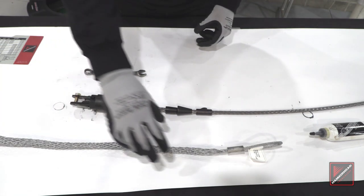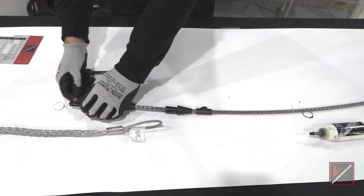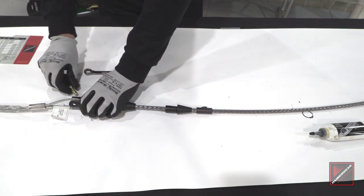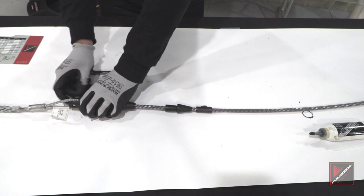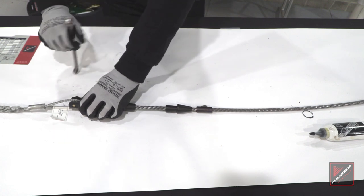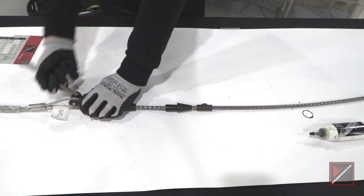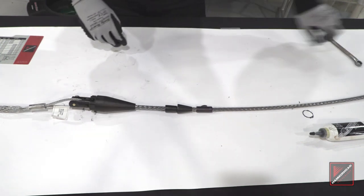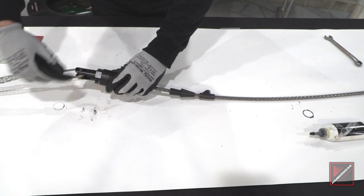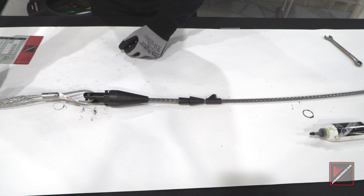The next part we're going to put on is the pipe puller itself to bring in our new product line. We're going to take out the screw back in this clevis, place a loop on our pipe puller in the clevis, and tighten down that screw and torque it up. Now that's ready to pull. We can also run the tracer wire through the milled relief clips on the nut itself — tape it to the puller so you don't lose it — and put your new product pipe inside the puller.